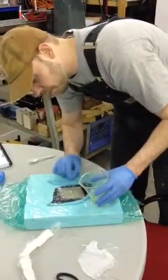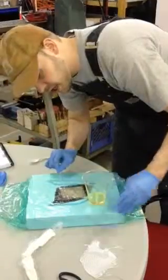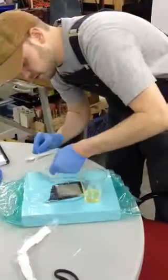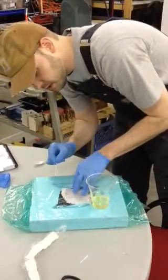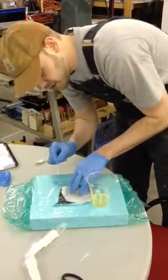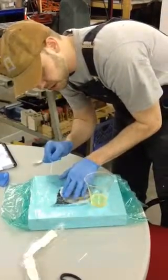This is called a wet layup, where we're adding the epoxy ourselves. I err on the side of over-wetting the fabric, and then I kind of squeeze it out at the end. Now I don't squeeze it all out. With vacuum bagging, with a resin trap, it'd squeeze out a lot more. But in this case, I didn't pour it on the last ply, the last sheet.